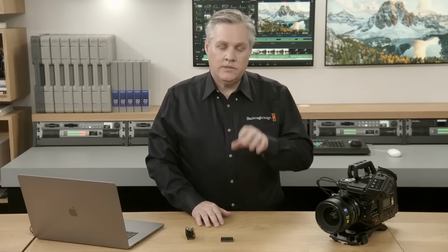So you can actually select lower resolutions in the camera. Now, before I mentioned something about Bayer. We're not really a Bayer pattern, we're a different pattern and it's symmetrical. So what it means is we've got the same amount of red, green and blue in the pattern on the sensor. So we can do in-sensor scaling, we can actually scale in the sensor itself.